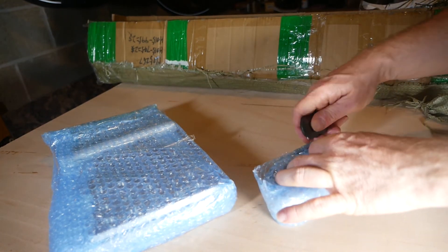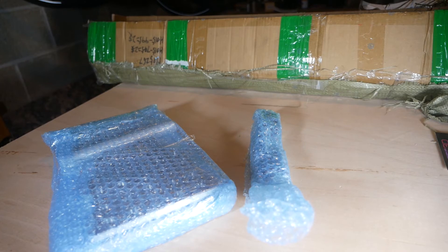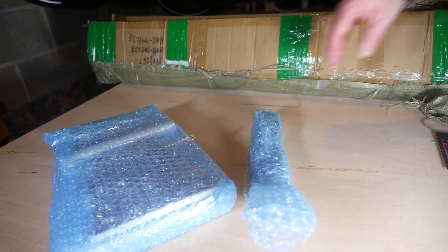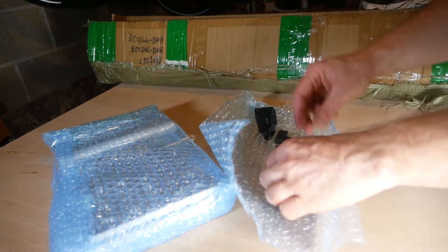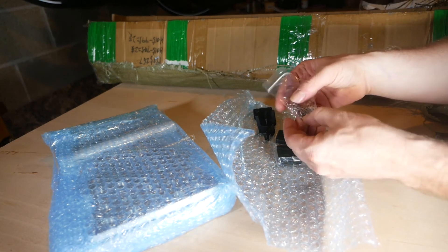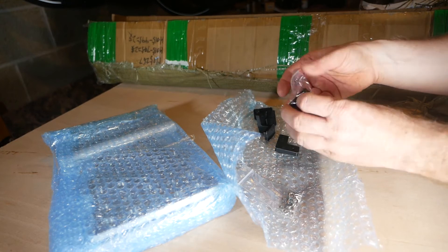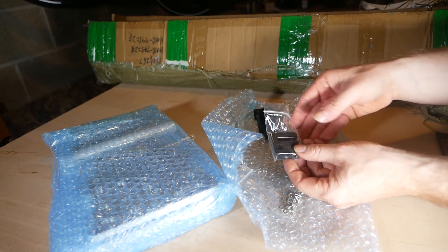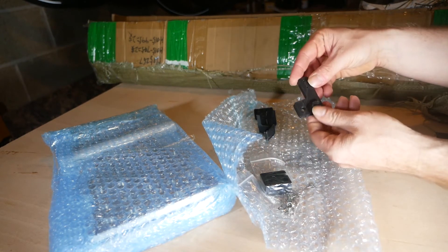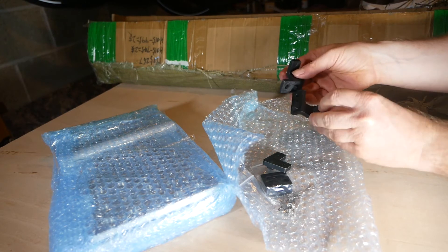What I'm expecting to find in here is all the linear adapter plates for the mounting, along with some shims, an Acme screw block, and some connectors to help for mounting the stop sensors and switches. Opening this package up - we've got these tiny little shims, looking to be about 0.75 millimetres, maybe half a millimetre thick. We have Acme screw blocks - if you've already got the Workbee, you'd have already seen this block; it's used in the z-axis, and now we're going to employ it in both the z-axis and the x-axis. And then we've got three 3D printed shaped pieces, which I'd assume are going to be for the end stops.